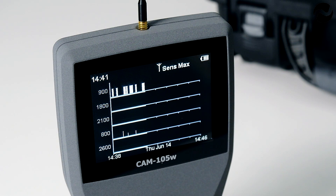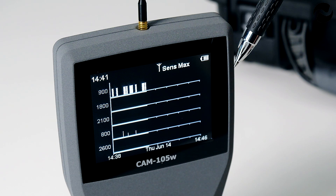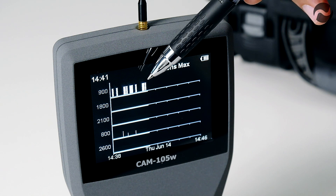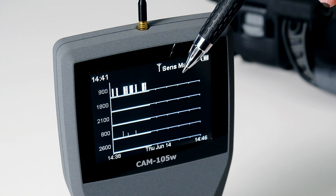The tracker has now been on for about two or three minutes. If you look at the screen on the 900 megahertz band — which is the band the tracker is transmitting on — you can see the pulses from the tracker with small gaps in between where it is not transmitting, and white lines where it is transmitting. That's how you identify that a signal is from a pulsing device such as a GPS tracker.